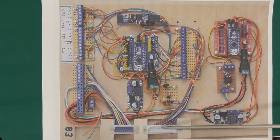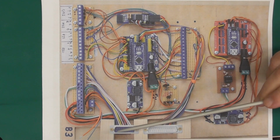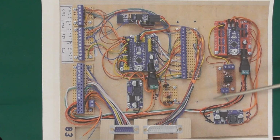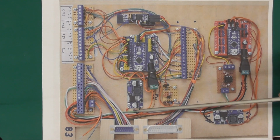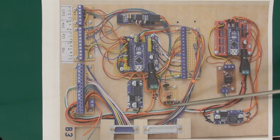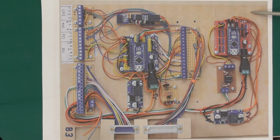And here we have the two connectors which bring in the power and connect all the signalling system. The small one has all the DCC on it and all of the 12 volts and 5 volts for signalling, etc. And that all goes, in this case, to here, and then the 12 volts and the 5 volts come off here, and the 12 volts goes to this block, and it produces its own 5 volts, and there is also 12 volts that goes to here, I missed it, to here, and the 5 volts for the signalling comes off here. This bit is all about signalling, and so is that bit. This bit is power, and this bit is all about point control.